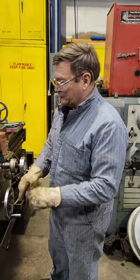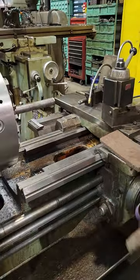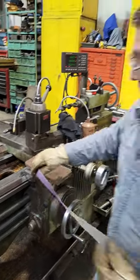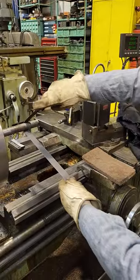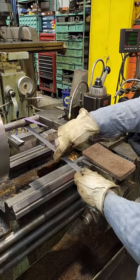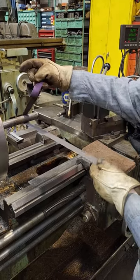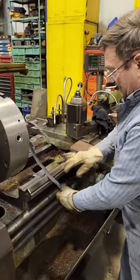One of the really basic things when polishing a piece of shafting — when you're polishing a shaft, people want to hang on to it. I've seen people do this and they say they're stronger than the abrasive, and generally you are, but it's dangerous, especially with gloves. I don't like it at all.